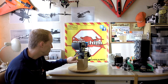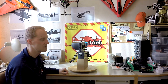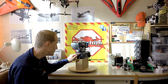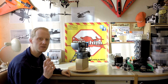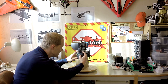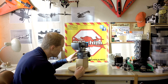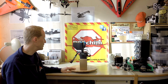Right now it shows me 3.8V for my cells. This is a battery I had storage-charged. It shows you the total, the difference, and the single cells. It goes up to 6 cells, though the connector is only a 4-cell connector. By pressing the preset button you can set, let's say, 3.5V with a long press, and now we have the LiPo alarm set to 3.5V per cell.